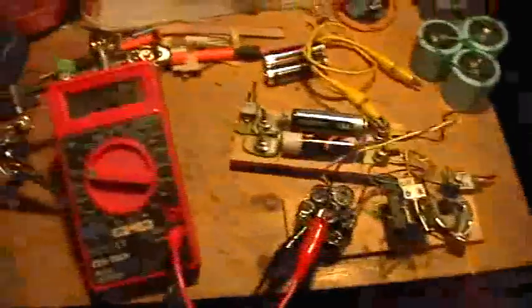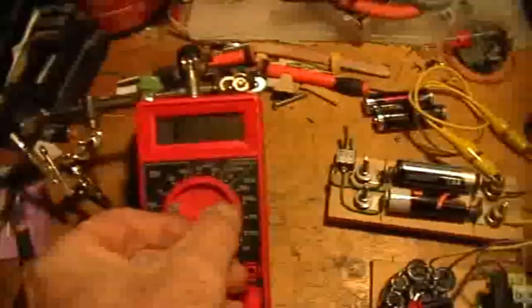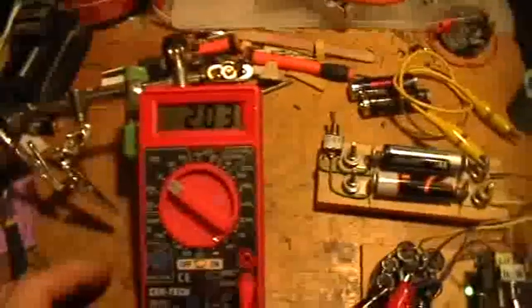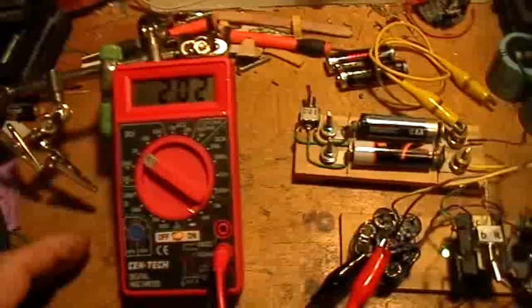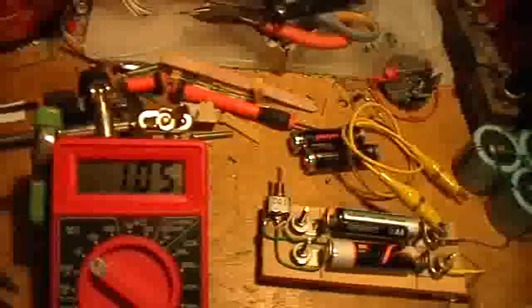If you start with a much more charged capacitor it does this at an even greater rate. With the circuit disabled and switching to the two-battery setting, we're looking at 2.03 volts on the battery bank — it actually started the Joule Thief even though I had it switched off. At any rate, that's two volts. Now I'll turn it off and the Joule Thief discharges and then stops oscillating at about one volt.